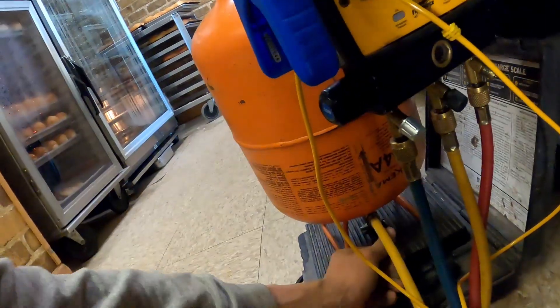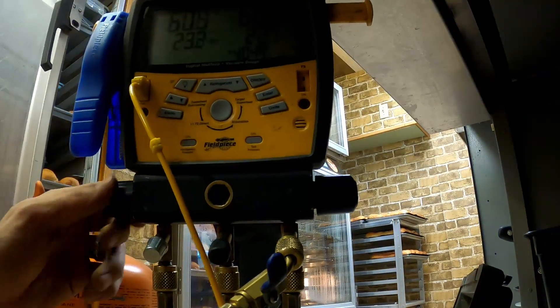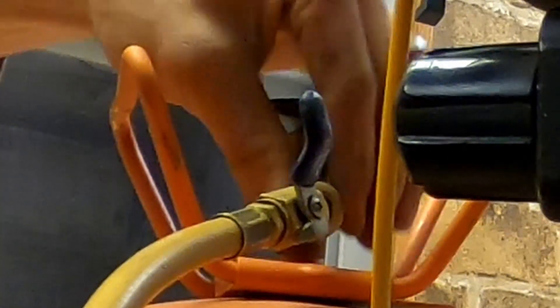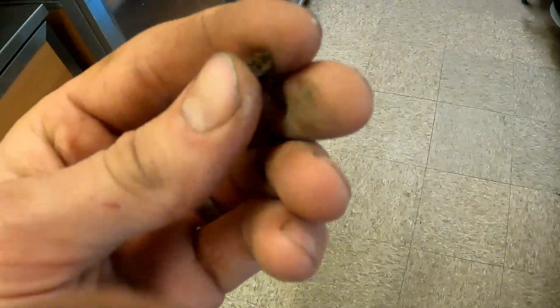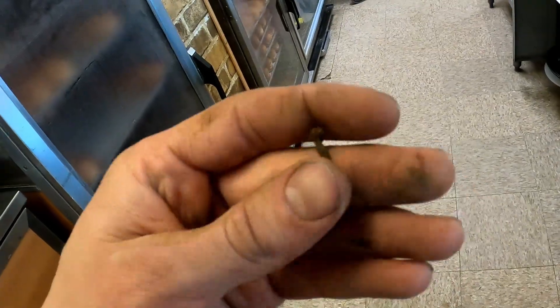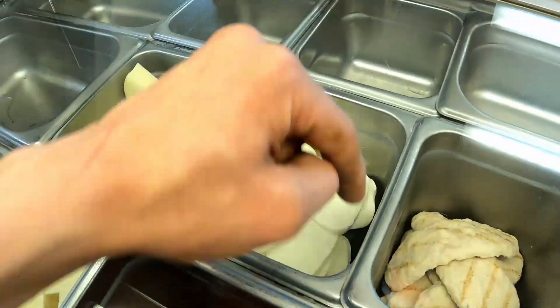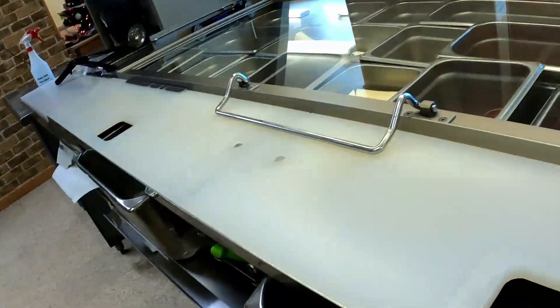There's 15 ounces — we're going to close this up. Here's one of those screws from that hose clamp that totally failed. Can't believe they used a ferrous screw like that — the other part was stainless, but oh well. You can see it's got frost; it just cools and puts frost on all these parts, like the walls and the dividers. Should be good. That pretty much concludes this call. I hope that you enjoyed it. Kind of interesting troubleshooting a system that has a plugged expansion device or regulating device.